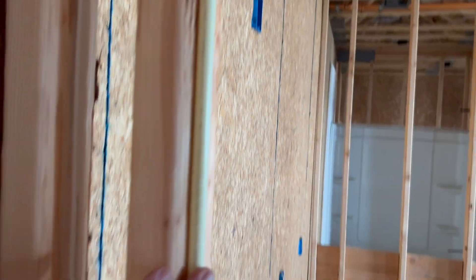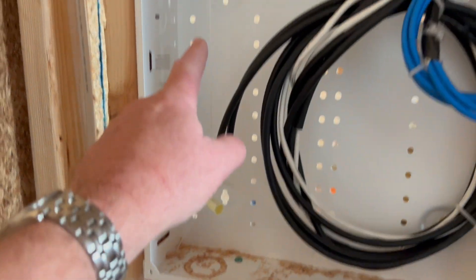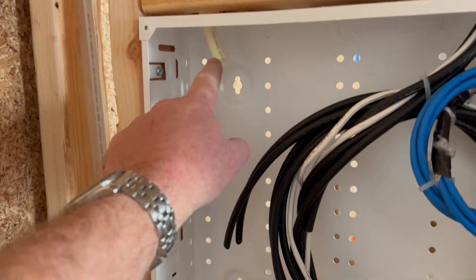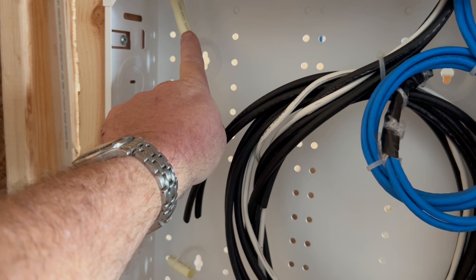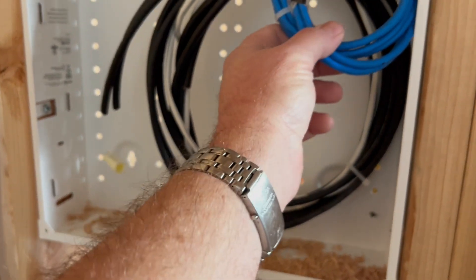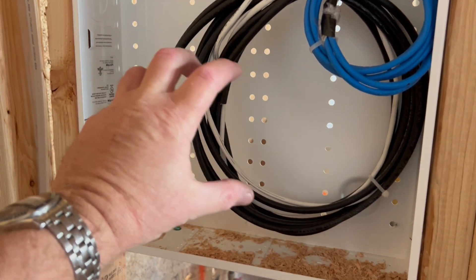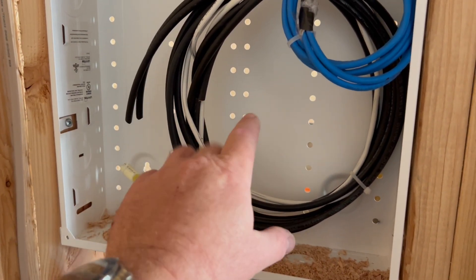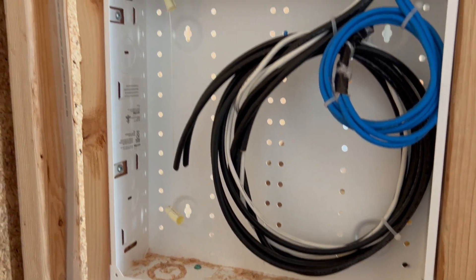They'll have this pipe and in here we'll have our enclosure. This is called a micro duct, and what we'll do is — it's a little rough right now — we'll pull fiber in there. They'll have their device in here with all our cable terminations. A lot of times apartment complexes will just have the coaxial for TV in this particular device.